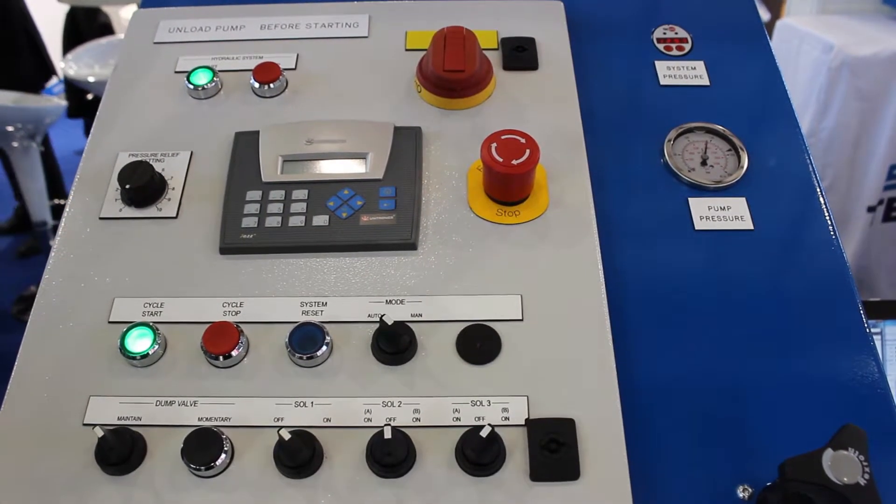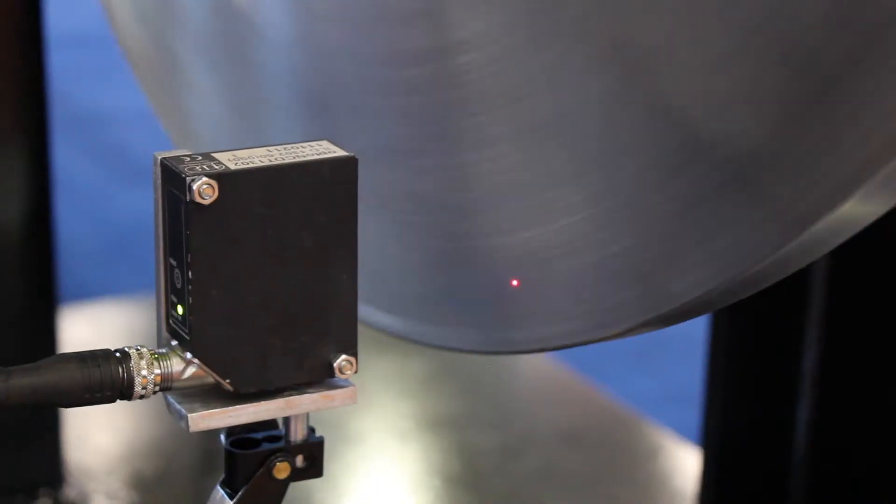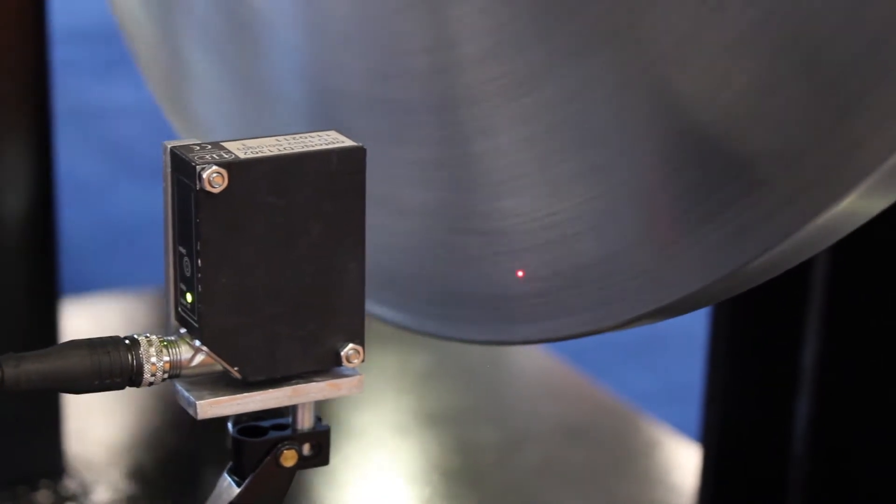This is one of our workshop test units that we use for overhaul of caliper brakes, and we can see the various plots on the computer in terms of the disc run out, brake application time, brake release time, and we can look at preventative maintenance for that function.